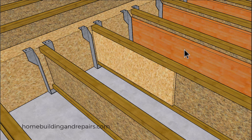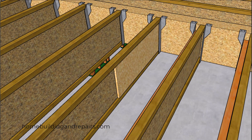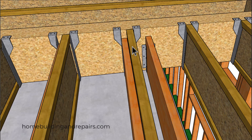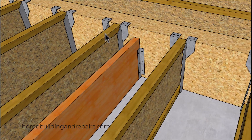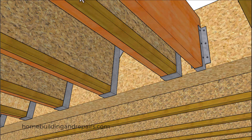The main reason I'm using conventional lumber here is because the manufacturer had a maximum cantilever of two feet for one of its examples, and ours is going to be four feet. There was another method for a maximum four-foot cantilever but I couldn't tell what kind of material they were using — whether it was engineered lumber or conventional standard lumber. Another problem could be the difference in expansion and contraction rates between the two pieces of lumber. If that's the case, you could separate them, go back to single joist hangers, and simply space these 16 inches on center in between the truss joist. Don't forget — I'm not using web stiffeners here, but you might need to install them. I've never come across a situation where you couldn't use them.